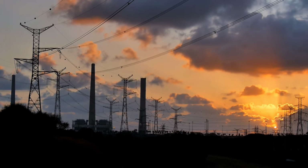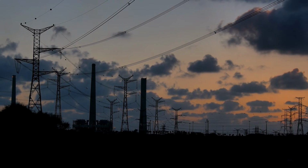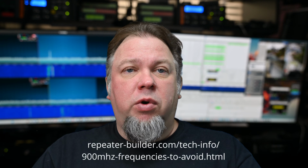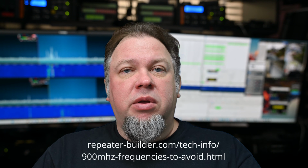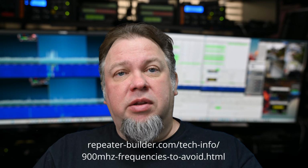Let's cover the 900 MHz frequencies to know and avoid. Please be aware that the 900 MHz band is not exclusive to hams. And as I had mentioned, we are the secondary users, meaning you may encounter wireless phones, such as cordless phones, which are still on the 900 MHz, as well as wireless internet and utilities and so on. Smart meters can also make quite a lot of noise here, if you will. The frequency ranges to avoid or at least keep an eye on can be viewed at this link, and I will leave that below. Depending on where you live and who you ask, the national calling frequencies are as follows.